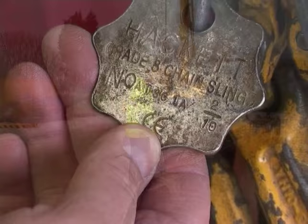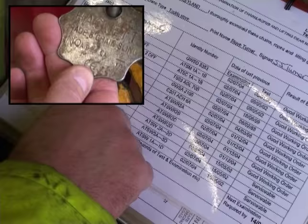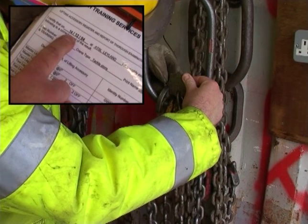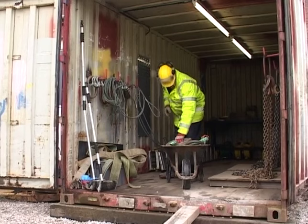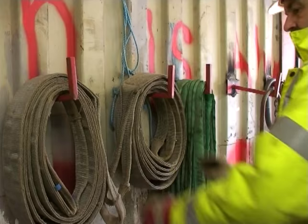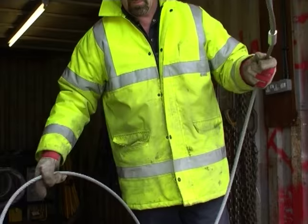There is some certification to be checked to make sure that the lifting accessories are legal and safe to use. All lifting accessories require the working load limit and a unique identity number to be stamped on the item or on a tag. These must correspond to a current six-monthly thorough examination report and a manufacturer's test certificate. All lifting accessories should be kept in a manner that will limit deterioration, damage and prevent unauthorized use — don't leave them lying about where they can get damaged, go rusty, and possibly be misused. Before using the lifting accessory, it's always best practice to inspect the item for obvious signs of damage, even though all the certification is in order.